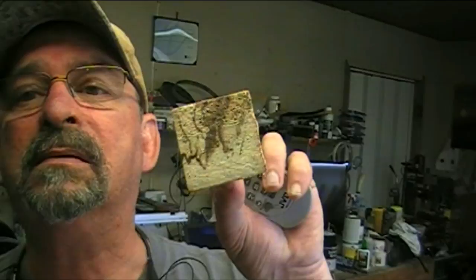Today I just wanted to make a quick bottle stopper and this is a piece of spalted pecan. I got it on this little mandrel that's for bottle stoppers. Basically you drill a 5/16th hole and then tap it, like I did that turkey pot call. So stick with me and we're going to do a quick bottle stopper, then check back with me next week because I'll have a shop update for you guys.